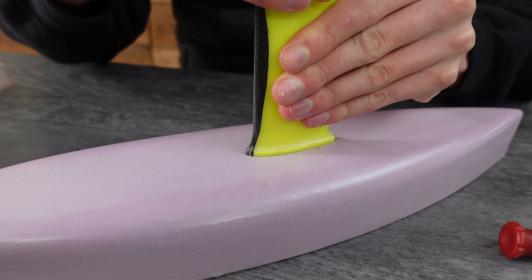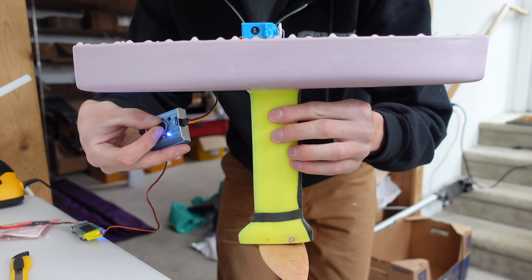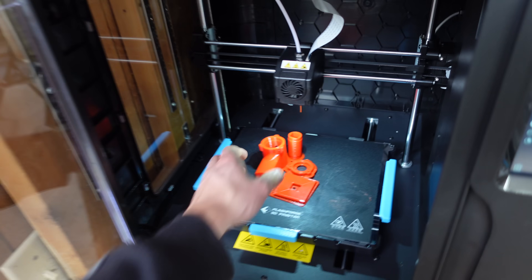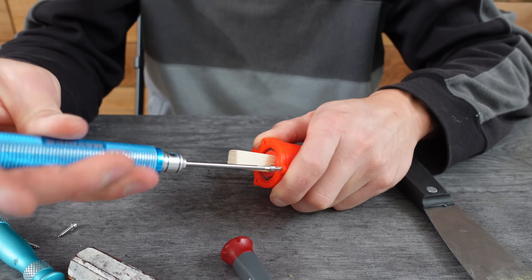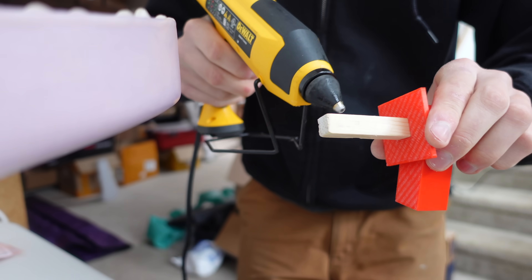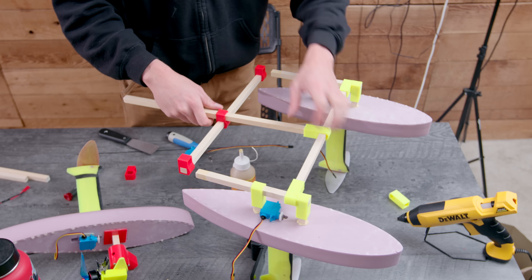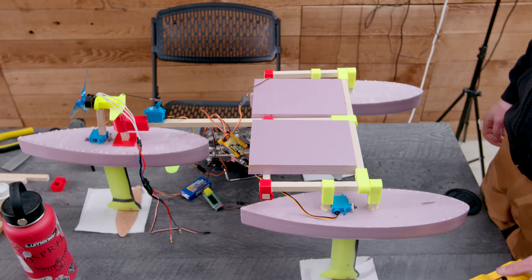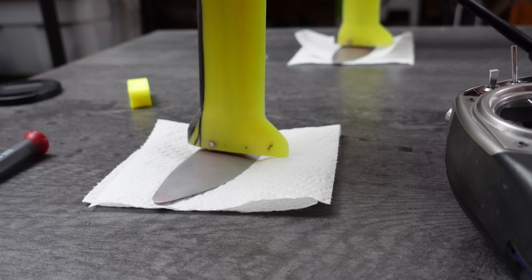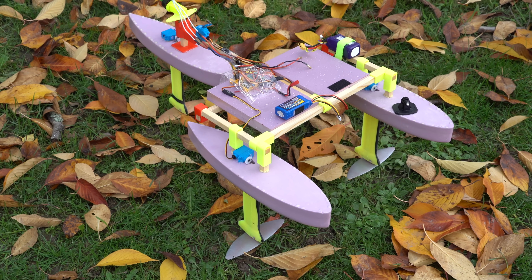Then I inserted the hydrofoils into the floats and installed some Hitec HS5086 waterproof servos to control the hydrofoil angle — shoutouts to the guys at Hitec for hooking me up with those. Then I fired up my new FlashForge Adventure 4 3D printer and printed some parts for the turning mechanism for the rear float, assembling them with a square stick, some bearings, and some screws to make a nice little pivot mechanism — basically our rudder. Next I 3D printed a bunch more little stick joints and assembled the whole chassis together. It's powered by a brushless motor and an air propeller mounted above the rear float, and this turns with the rudder, so it's like thrust vectoring. The two front foils are controlled exactly like elevons on a delta wing, and the rear foil is basically just an elevator. For the first preliminary test, I'm not using a flight controller on board — I just wanted to see if I could control it manually without the help of any sensors.